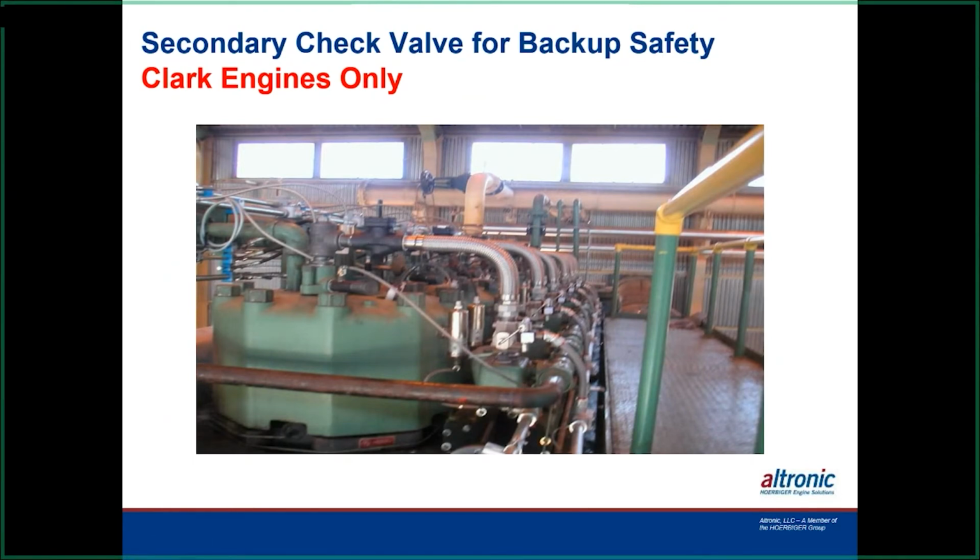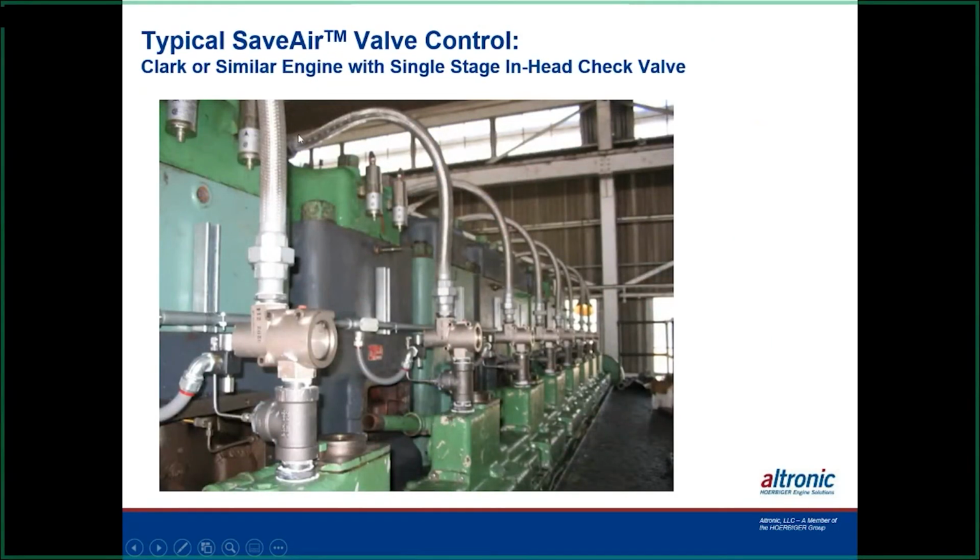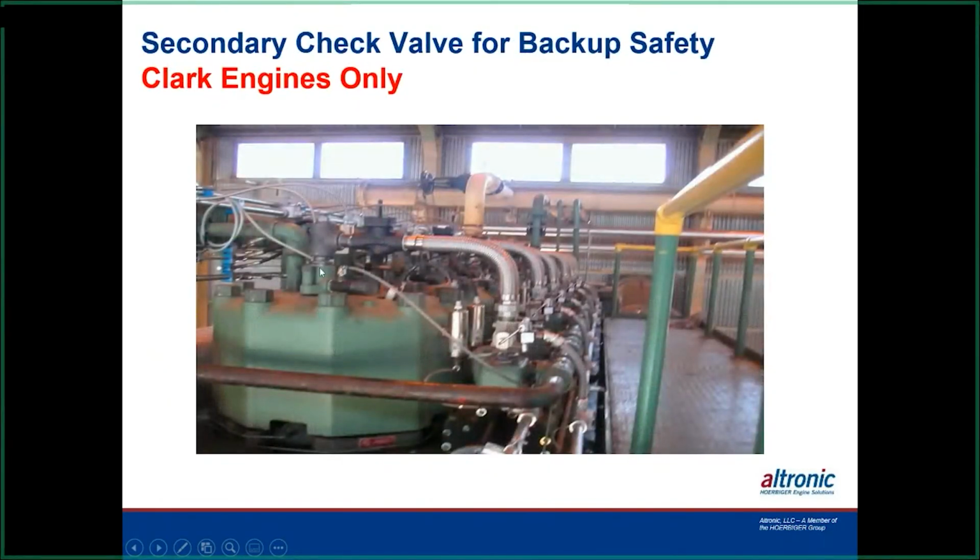We recommend that you add the check valve, but one thing we have found out recently is that by adding this extra weight up here, and I'm not sure it would bother this design any because it's a fairly short hose, but in this case, with all this extra line up here, it adds a lot of stress to this part of the valve. Because these valves are pretty old, we've had some customers where it actually cracked the valve, not the inline check valve, but the one that goes in the head. They blamed it on the extra weight.